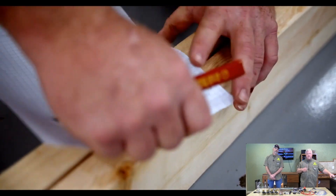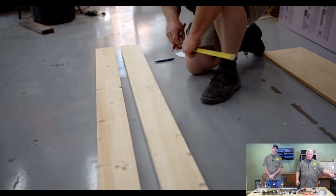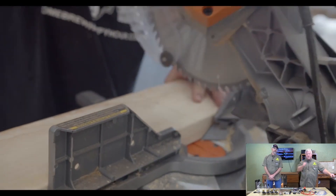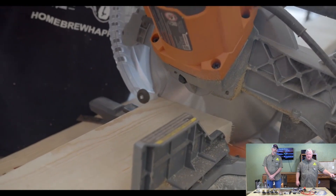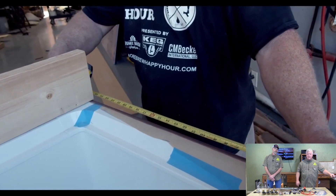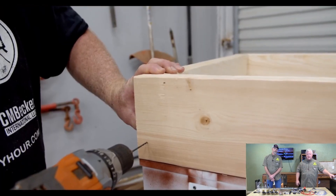I'm showing you there that the two boards put together are three inches, because these are going on the inside and the longer boards are butting up against them. Whatever your measurement is, you need to take three inches off of that. I just cut this with a chop saw — a circular-type chop saw. You could do this with just a standard handheld circular saw. In fact that's how I cut the nicer boards because my saw doesn't have a big enough blade to go through 12 inches. I like to line these things up when I'm done and then take that inside measurement again just to make sure it's exactly what I thought, because you're going to move those boards in and out a little bit to make sure you have that collar where you want it on the front.